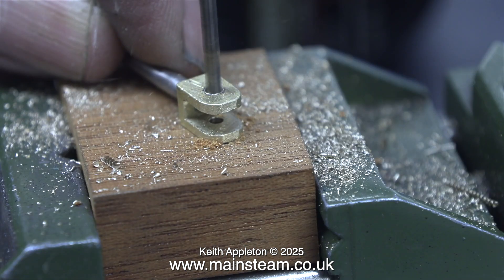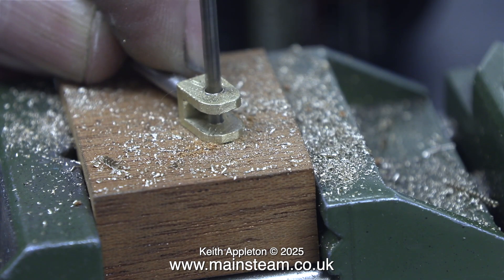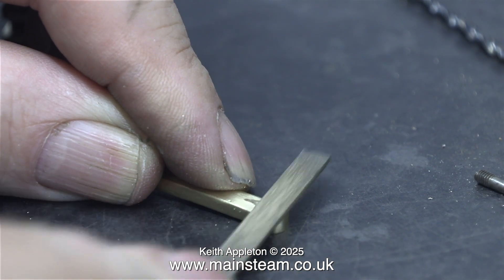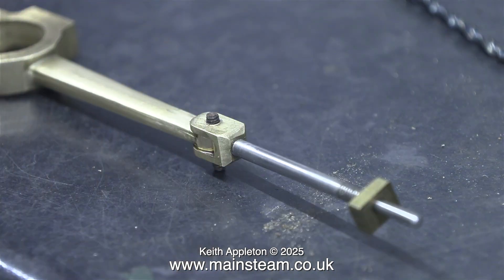In this case I decided to go for it straight away with a small drill bit, then a slightly larger drill bit, each time putting the required pressure on the drill bit to keep it in the centre of the work. Finally, to make sure that everything lined up perfectly, I ran a third drill bit — which is a tiny bit bigger — through both the valve fork and the eccentric rod together. The eccentric rod was too good a fit in the valve fork, and this is not what I need. It needs to be a perfect fit, but not an interference fit. I filed it down so it all fitted together, and here you see the small stud through the centre. With a nut on each end, this will hold the short stud in position, and of course the stud is not threaded — it is of the plain shank type.